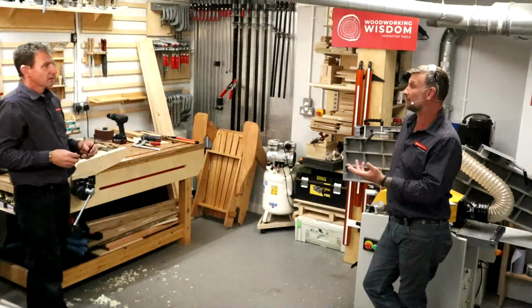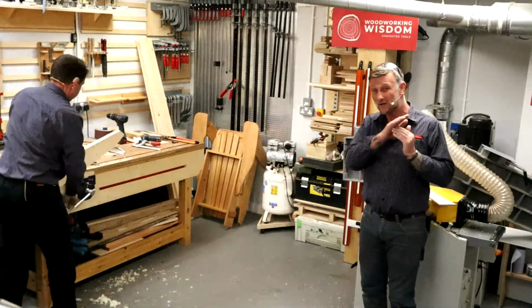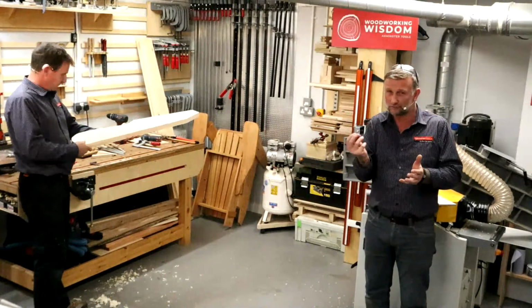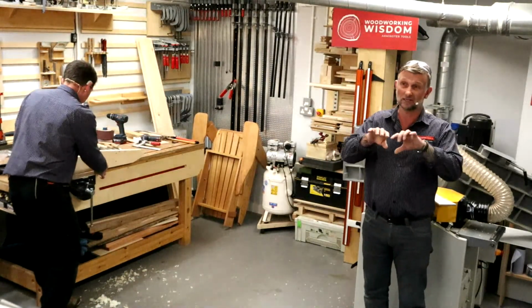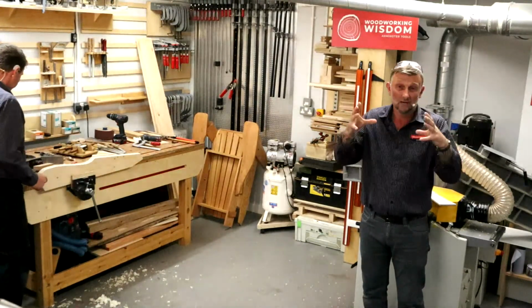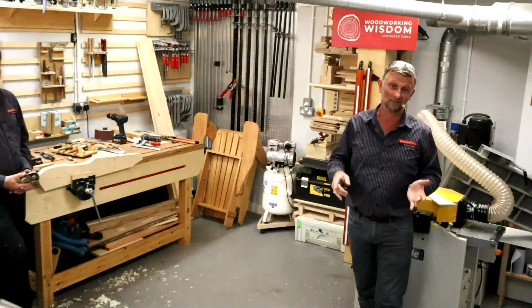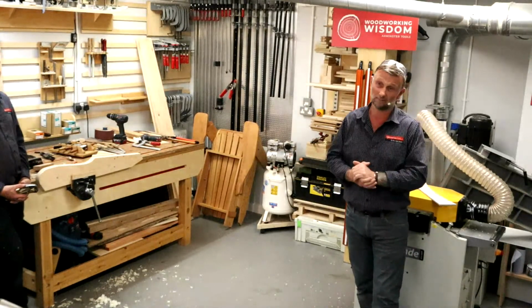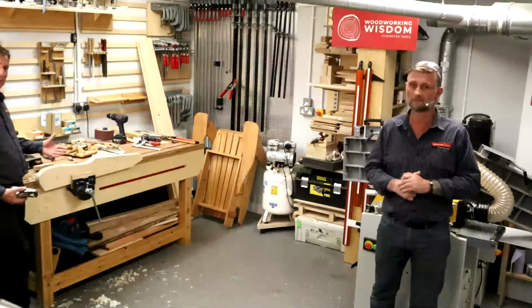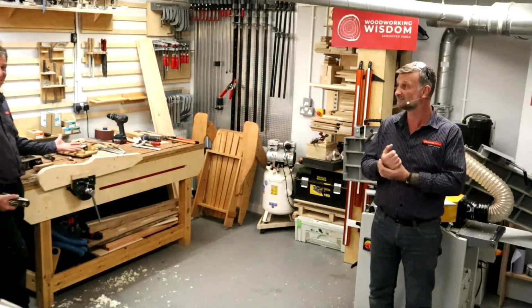Well, I was just going to say that, yeah, if you can get kind of plain decking, that would work, relatively cheap. However, if you cut into it, you've got to treat the cut surfaces, really. Otherwise, it just rots from those cut surfaces inside, because it's only pressure treated quite shallowly, on the outer perimeter of a board, and it doesn't go all the way through. So if you cut particularly in fancy shapes like this, you're going to have to treat your cuts, really. But yeah, decking's, why not? And obviously, as you've just said, wherever you cut through, you're going to have to treat as well. So if you go with what I would class as green pine, weather resistant outside, where you cut through, you've got to treat. Yeah.